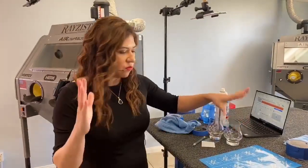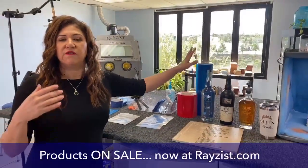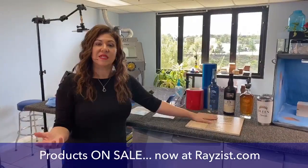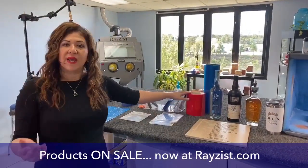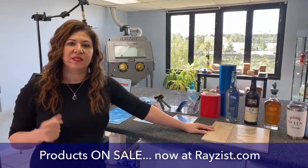But let's talk real quick again. Let's kind of go over what we talked about. We have our sand carving system. You're able to blast on glass, wood, metal, stone, all of those materials you can etch, you can sand carve. Photoresist film, you have different thicknesses. It comes in 3, 4, and 5. If you start blasting on stone, you can use a 6 and 9 mil. Laser mask for the laser engravers. Leave that stencil on after you're sandblasting, add a paint fill.